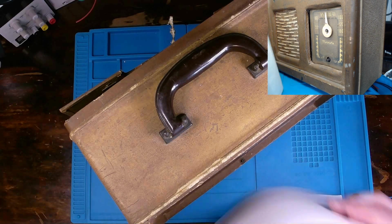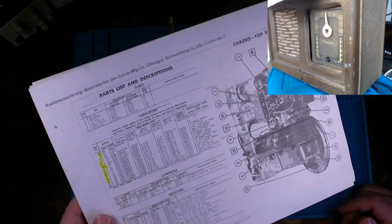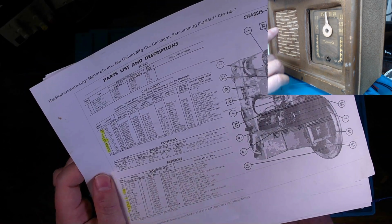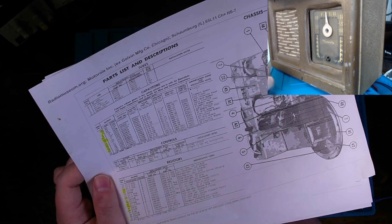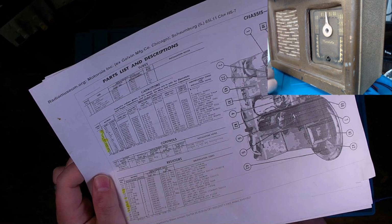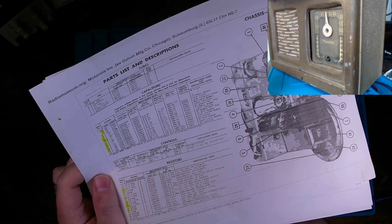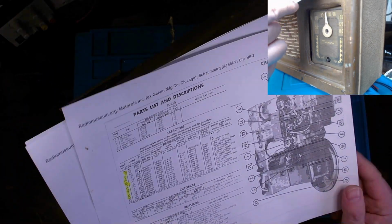After that analysis, you can see on this document here, I tested and took a look at all of our paper foil type capacitors, highlighted them, and tested all of our resistors. Any of the resistors that were 10% out of tolerance or greater, I decided to highlight, and those we'll be replacing as well. So I did a quote for the components that need to be replaced.